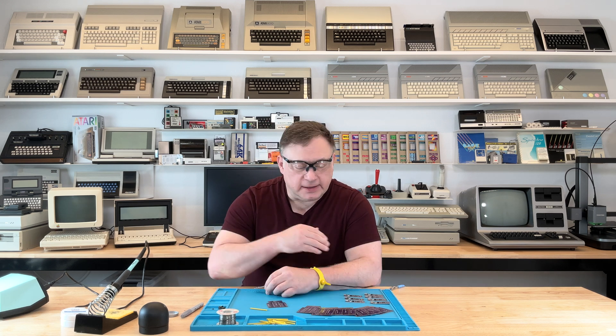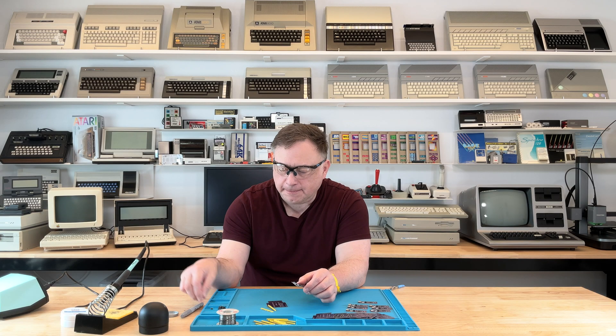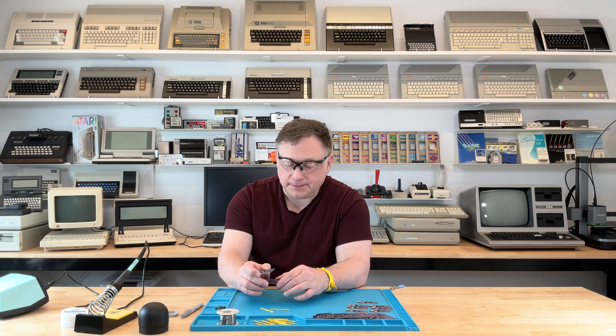As you can see here, I've got plenty to work with. I'm just going to solder one on the video today. You need a couple of headers, a switch, the PC board, and the Raspberry Pi Pico clone. They call this the purple clone, and there are some iterations of that. You want not the regular Pico, because this Pico clone has some extra GPIO pins — general purpose IO pins — that are needed for this project to work.